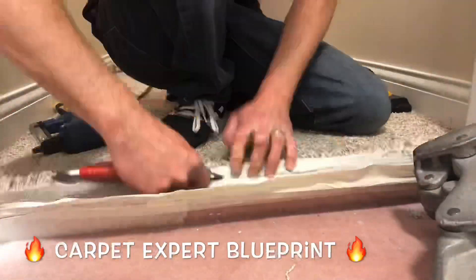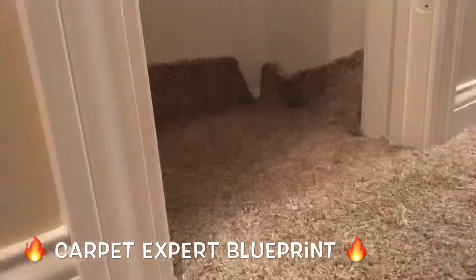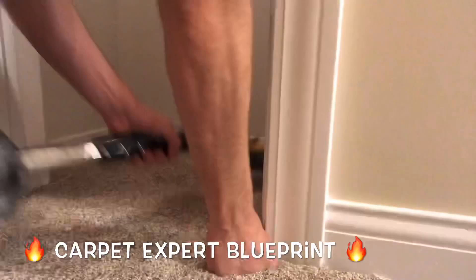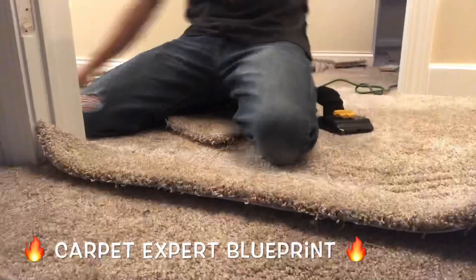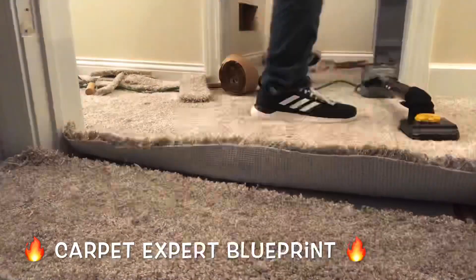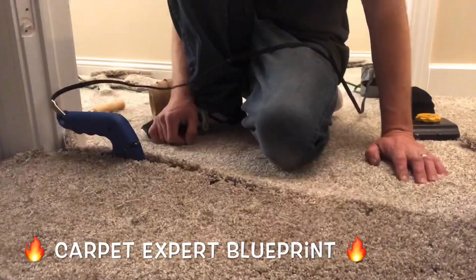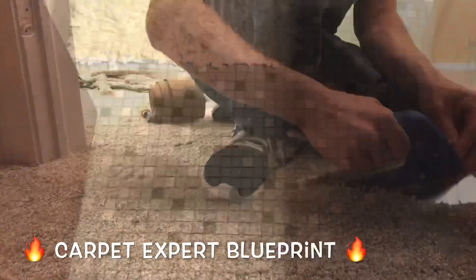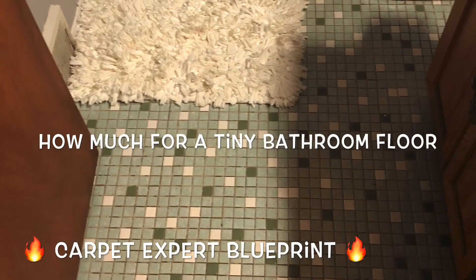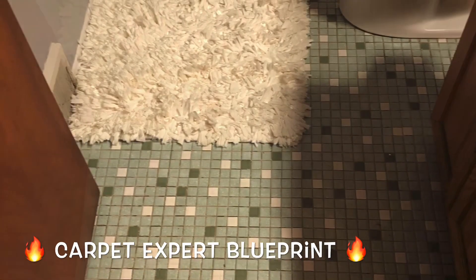The key to this video: when you are dealing with ridiculously thick, heavy carpet, preparation with your tack strip is key. You want to use extra sinker nails to make sure everything's holding in place. Anybody could blast on a room, but if that tack strip starts to come loose it's just going to buckle within a year and it's a hot mess. Take the time to make that happen. Now let's get onto some bathroom estimates and cover the key points that many people overlook — both homeowners and installers — and end up losing money on both sides of the table.